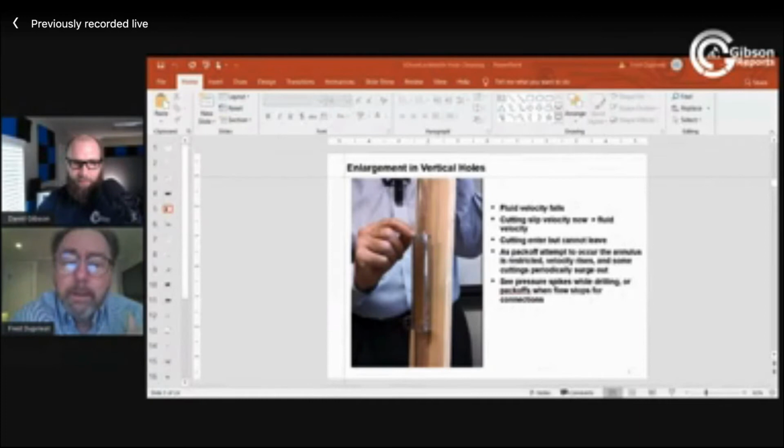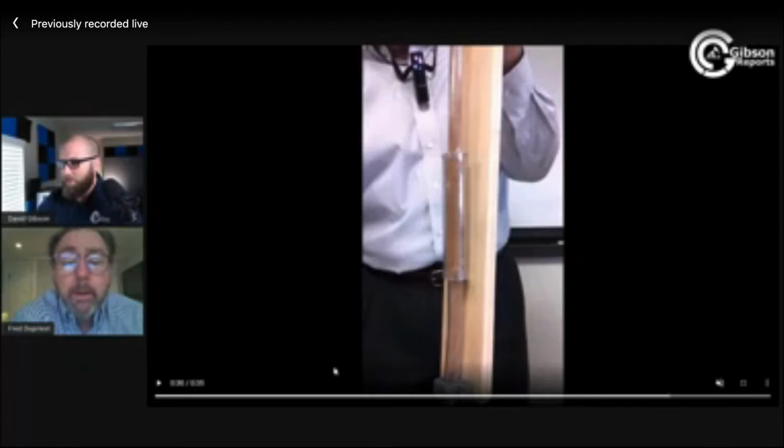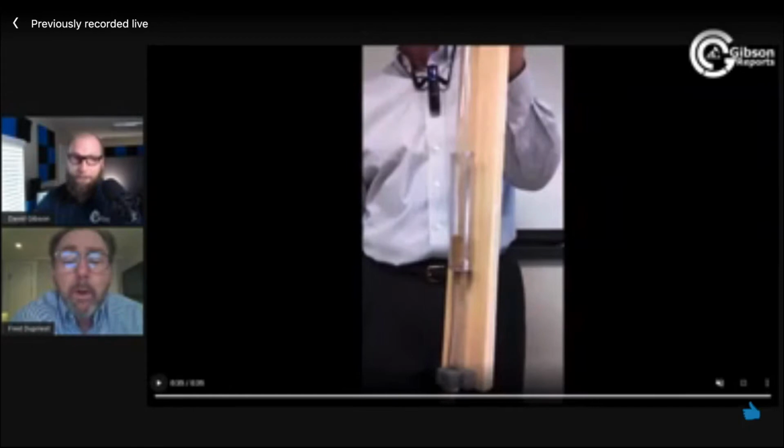If you could go back to the end there, David, of that video. Right there. So what I did right there at the very end was I turned the pump off. What happens whenever we are drilling and we have an enlarged hole is that we actually don't really see very much. Maybe a little bit of pressure spiking. Stop right there and hold it. It's only when we turn our pumps off that the really bad things happen, because it all falls around our drill string and it bridges off across the hole.